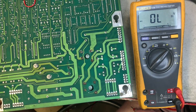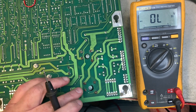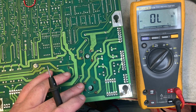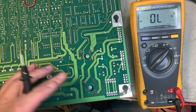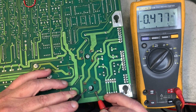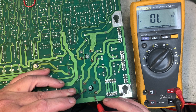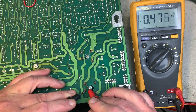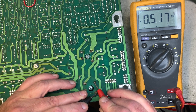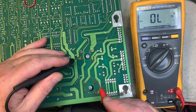Back at the bench — I can quickly show you how to test bridge rectifiers. This is BR2; a lot of people change this rectifier out trying to solve reset issues, but there's never any need to do that. Here's BR1, which is the one I suspect. To test a working bridge rectifier first: I have black on the leg of the rectifier that is out of square and red on the flanking legs, then go across with red and black on the flanking legs — that is a good bridge rectifier.